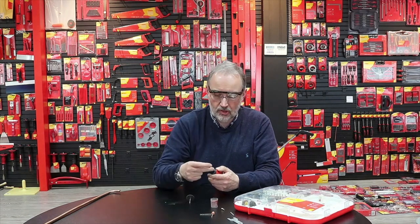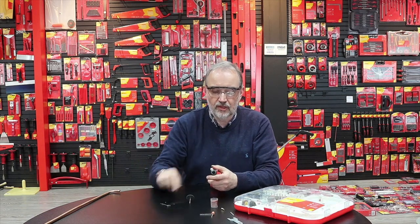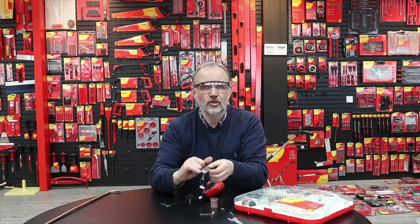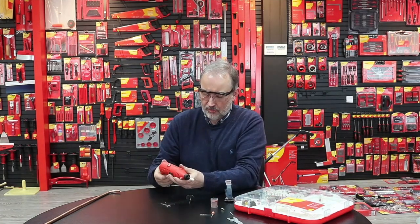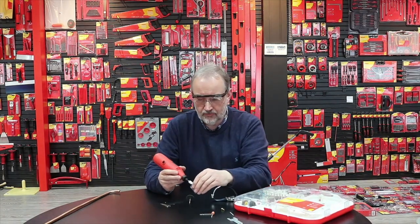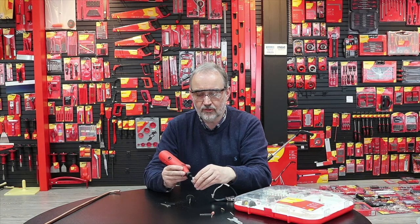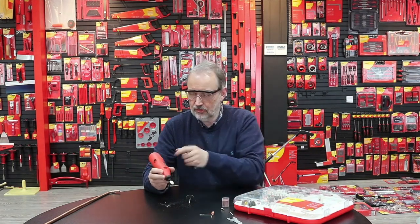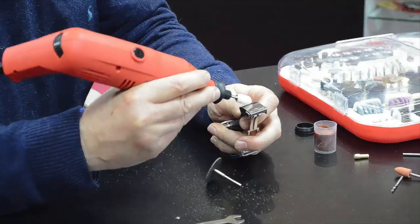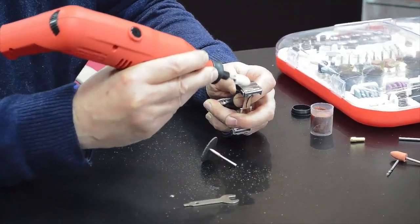We'll put the felt polishing item on here. This needs to run at lower speed because you're polishing. So if I just took my watch off, and you might have scratches on the clasp of your watch, if you start it up slowly, you get two pots of the red polishing compound. Just put the end of the felt in at low speed, it'll soften up the polish, and then you can increase the speed a little bit, and use it to polish out marks on silver, jewellery.